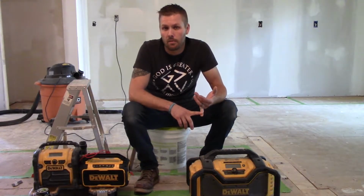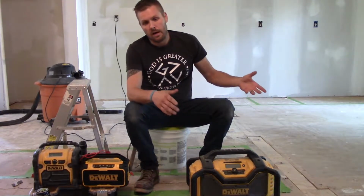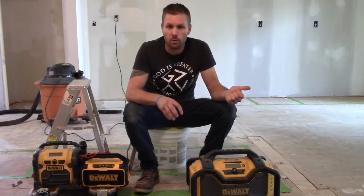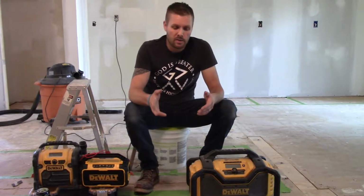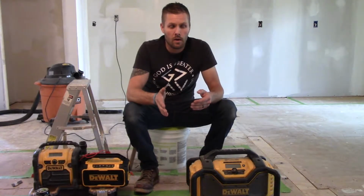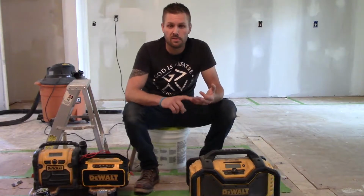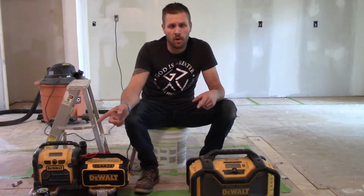So I replumbed most of the entire main feed, is what you've seen in the video so far. So that's about 50-ish foot of pipe. I put a ball valve in, new ball valve, re-glued onto the main, and then ran everything in PEX to the water heater. So what I've got to get underneath of there and do today is to cut into that 3/4 line and do all of my half-inch supply feed-offs for toilets, sinks, vanities, washer box, all that. And then also run my hotline feed.